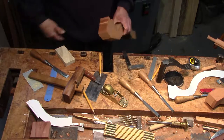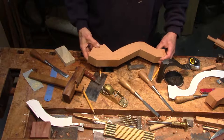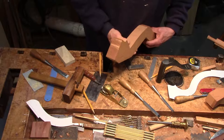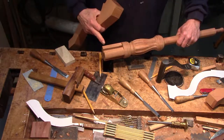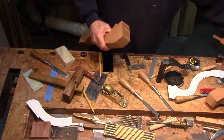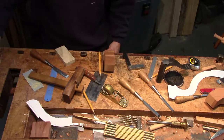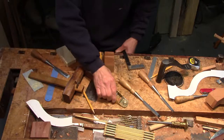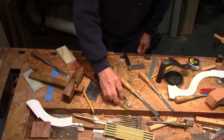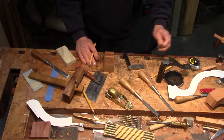I'm getting ready to make the dovetail connection on this roughed out cabriole leg. This is the end where the dovetail and this face, flat face here, matches up with the flat face on the post. So there'll be a dovetail tenon in the middle of this face. After it was bandsawed, I used the block plane to clean this up, flatten it up, and get the ripples out of it so it will be in good shape to match up